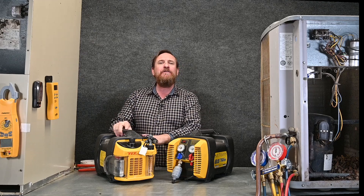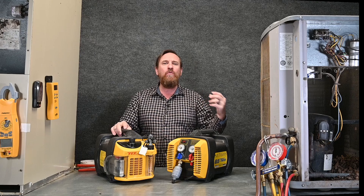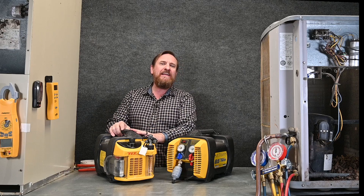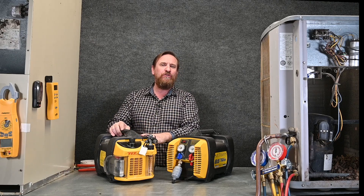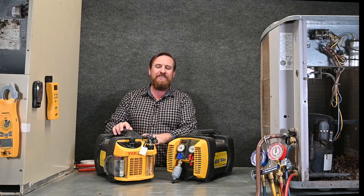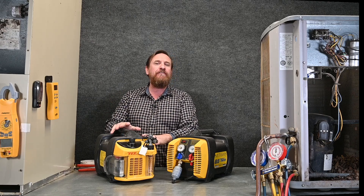That's where our vacuum pump comes into play. The vacuum pump's job is to pull from about one or maximum two PSI down to a deep vacuum so that we dehydrate the system. Think of this vacuum pump as a dehydration tool — we get rid of moisture so it does not turn into an acid. This vacuum pump works really great for what it's designed to do.